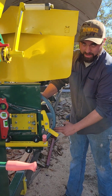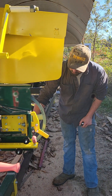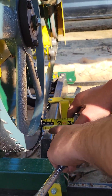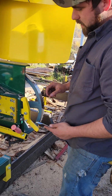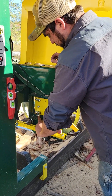Now the blade is hanging off the back. On the front side, you want to measure so that the front edge of the wheel to the tip of the tooth is seven-sixteenths. Now that I have that at seven-sixteenths, I'll take my three-quarter again and snug these back up.